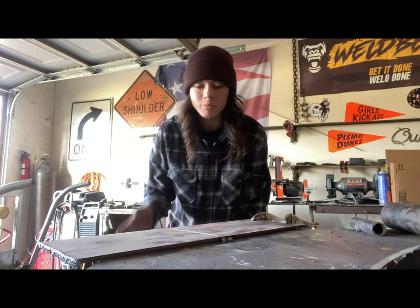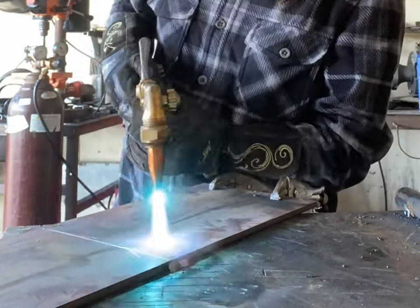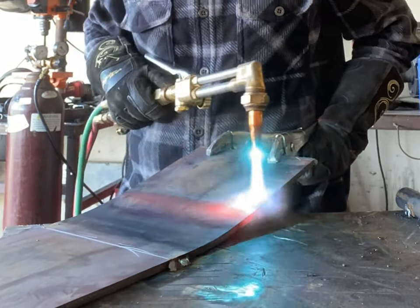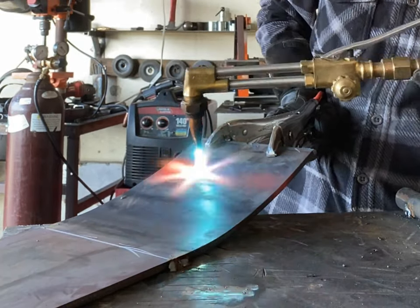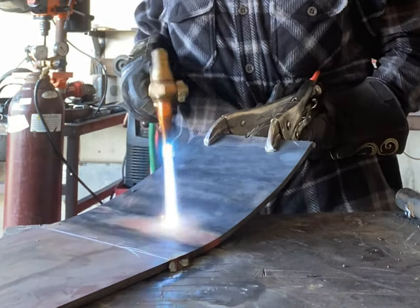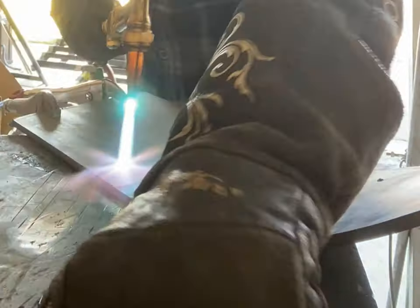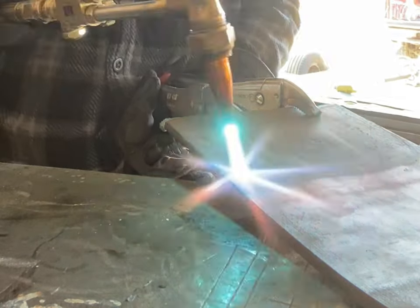Just close them off together like that. There are other ways to do this — I don't recommend them because it goes against gravity when the heat's coming down. So one of two things: either if you're going to be making these, an easier way to bend them is with an oxyacetylene torch. This is the one way I'm doing it. If you have an English wheel you can do it that way. This is the best way I found. I tried every other method — I have an English wheel but it's just not set up. So this was the alternative solution. This is quarter-inch material — all steel.